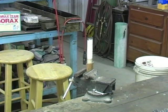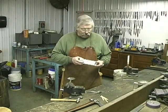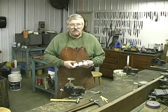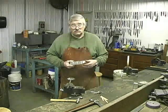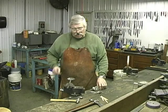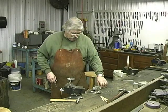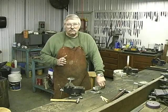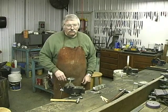Okay, now, there'll be a place where you can buy pewter, or you can go online. There's several different types of pewter. If you get the food grade pewter, it can be rather expensive. It varies with the metal market, but it can run as much as $15 a pound, as cheap as maybe $6 or $7 a pound. This is food grade pewter, because we pour smoking ends on tomahawks, and the food grade pewter is prettier, it's shinier. I think it has a high tin content. I don't know for sure, so I'm not claiming to be no expert at this. I'm just trying to show you how I do it, and take what you can learn from it and use it for yourself.